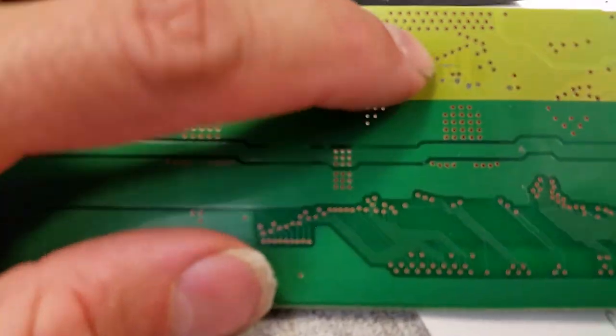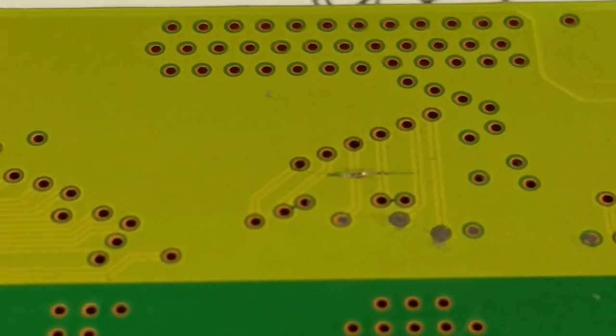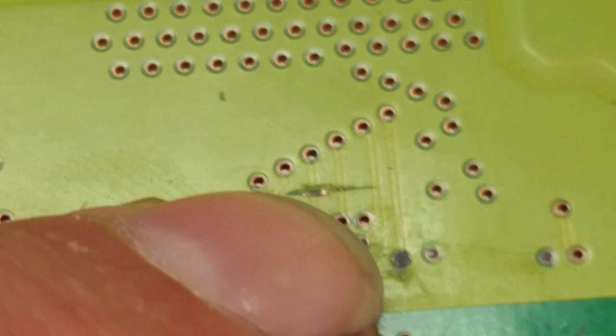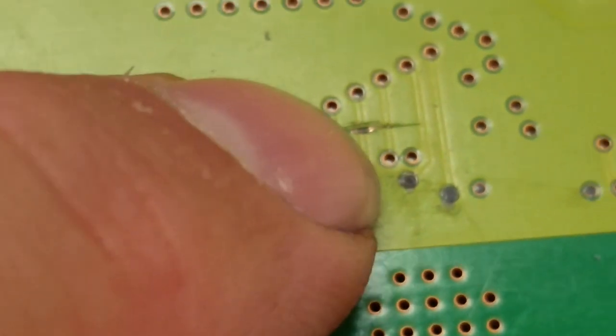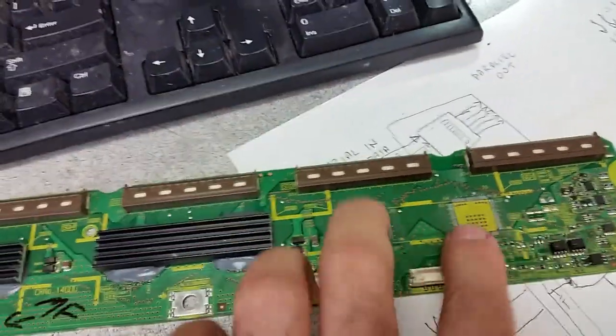And in this case, there it is here, let me see if I can zoom it in. It's either the direction in which the shift is going, but anyhow, I was lucky. The very first IC that I cut off was the one that was bad. This is the tiny wire that comes from here. This hole up, I've cut through, and this basically isolated that IC as being bad. So we'll have to replace those two.